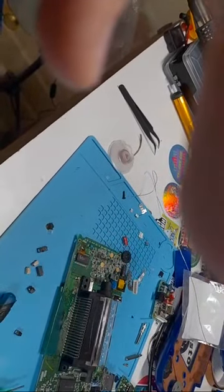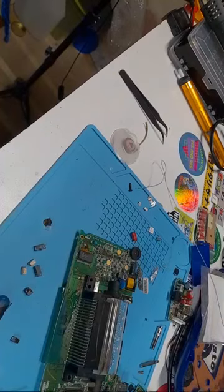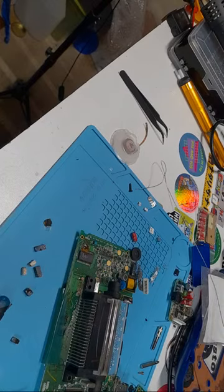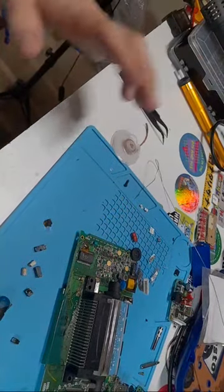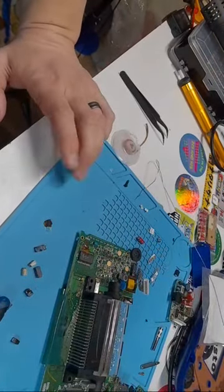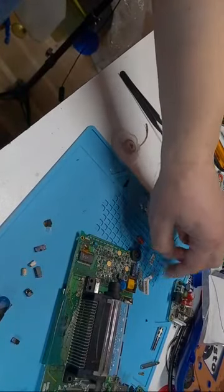Save the consoles, man. Ceramic caps behave differently, and you just absolutely lose a lot. Yeah, that's a very good point. I think some folks used Retro 6's capacitor kit, and then they went online and they're just trashing it. They're like, oh, the values are off. But then people in the comments were like, well, that's just electrolytic capacitors, unfortunately. However, they're highly requested. I get a lot of requests for them. I've been selling the electrolytic ones for like a year now, and they're probably my best seller. So if people want to use electrolytic ones, they got them.